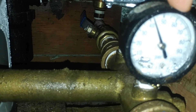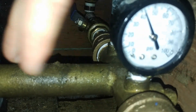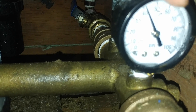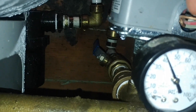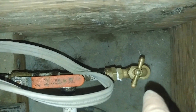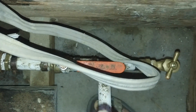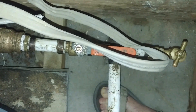This is a pressure gauge — it tells me how much pressure is in the system. It'll drop slowly as water is used, drop to 30 psi and kick on. This helps me determine if the Square D is functioning properly, so you really should plumb that into the system. Then it goes out to another shutoff that can shut off the whole system from the main. I also put a valve to drain the system if I need to change the pressure tank. There's another teed-off pipe that's shut off permanently. Then everything goes down into the house.